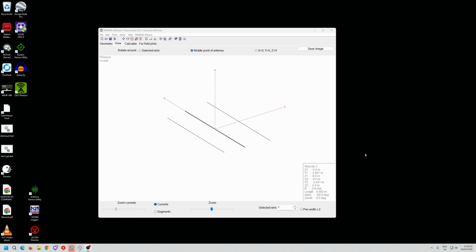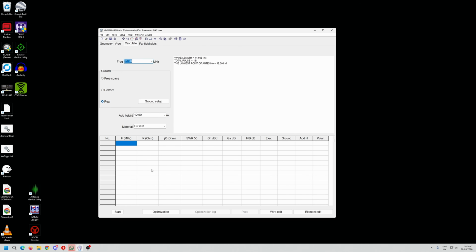A very good day. Well, today we're making a 15-metre Yagi, a monobander. We're going to build it so in future we could interlace a 6-metre 4-element Yagi on top of it. I've got all the hardware behind me here, but on the screen here I've got it. What it looks like is a typical Yagi, and this middle element, the one that's highlighted slightly thicker, is a little bit forward than normal, so we get a reasonable match.